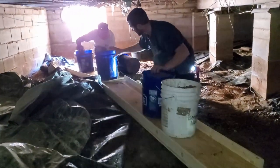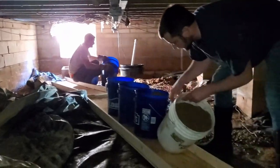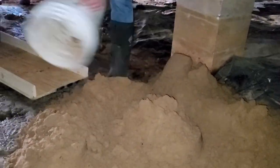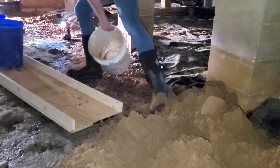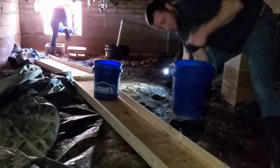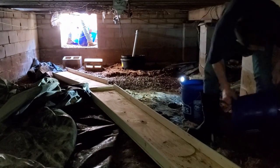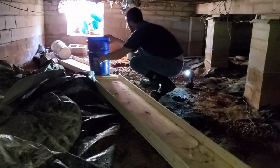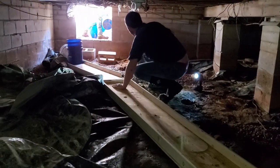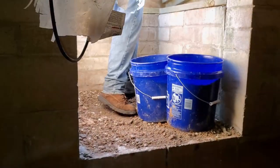It's like the bucket brigade. One guy is bringing sand to the buckets, bringing it to the beginning of the crawl space. Then another guy puts it on the slider, another guy slides it to the end, and you can see we're filling this up really quick. I'd say it's going to take about four yards of soil altogether. We've got two yards in the trailer and we'll go back and get another load. Down by the sump pump we're going to gravel that area — we want that water to perk. We've already got footer tiles installed; we want that water to get down into the pit. Remember, this is water coming up, not coming down. That's the way all French drains work — they're not designed to pick up surface water.